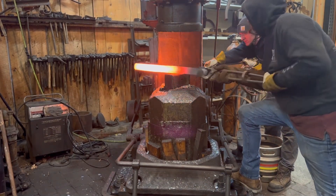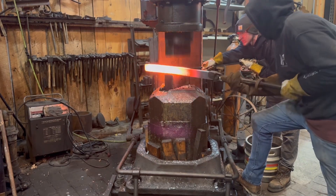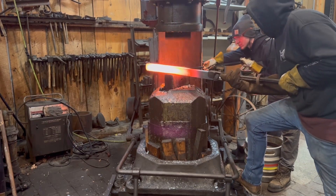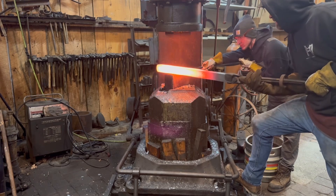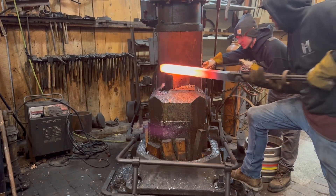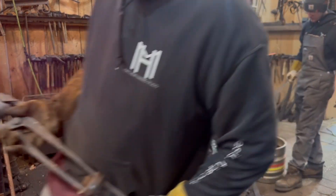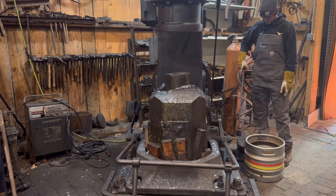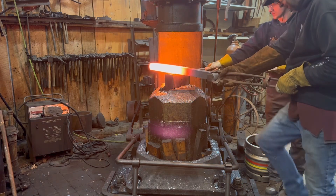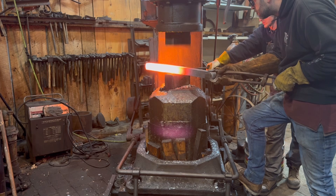Alan's working with me here with that sizing block cut to 2.1 inches. You can see the bar bounce a little bit as I try to work that center section — I'm actually working a little bit over the halfway point on this bar. He's nodding his head to let me know he can feel the die bottoming out, and then again over to the 200-ton press to press it flat. We also used a 2.1-inch block under the press to keep from over-pressing the material.